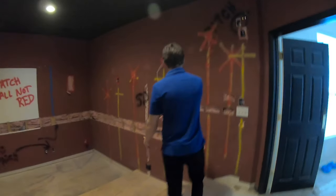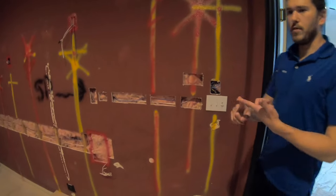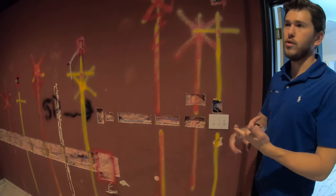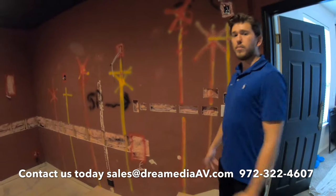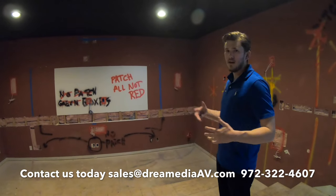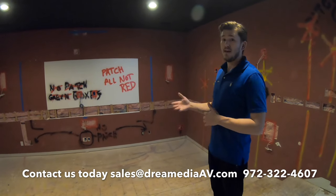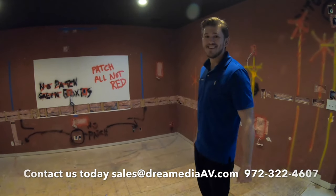All of the wiring is going to be routed into three separate switches — one for sconces, one for step lights, and one for cans. Through the remote he'll also have the ability to control the RGB strip in the ceiling. This is going to be a pretty cool project — wiring's in place now and we get to start putting the fun stuff in: carpet, drywall repair, columns. It's all going to come together really nicely. Once we're back and popping speakers in, we'll upload a video to show you guys how that looks. Thanks for watching.